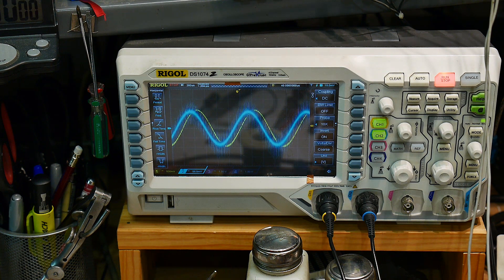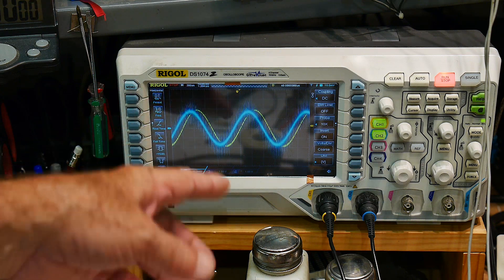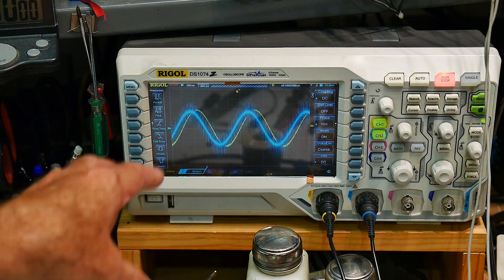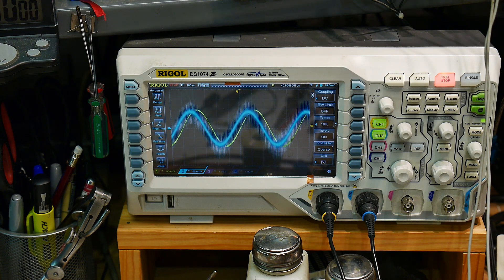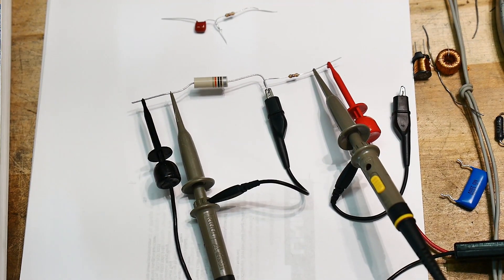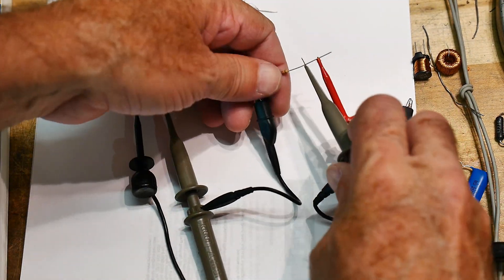The angle is not a 90 degree angle — it's different than 90. There's an error between the ideal inductance and the real inductance, due to it capturing energy with magnetic fields and such. But you'll see that by having those three numbers again, you can calculate anything about this inductor. So let's measure these with the actual machine itself.